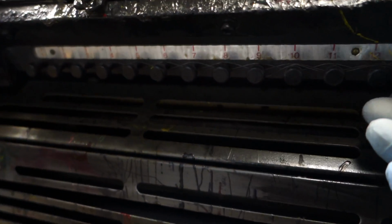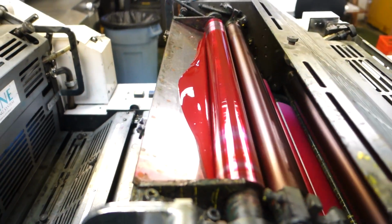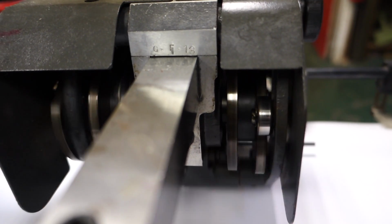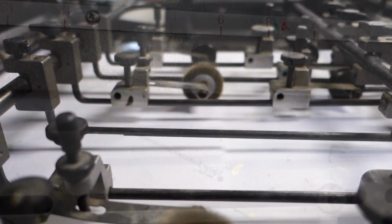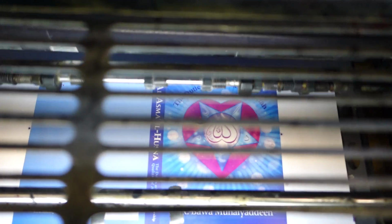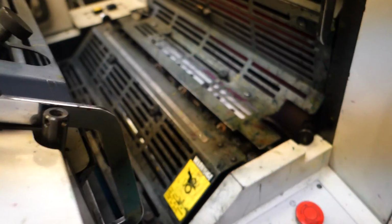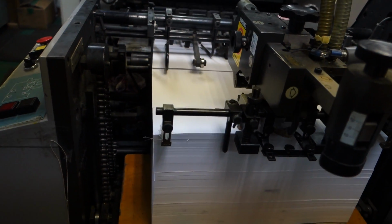And it's not an automatic process. You have to go through and adjust each of these keys. And it's trial and error, and it's not automatic. It's not a Xerox machine. So these are the first 2 colors coming off. And they have to be registered perfectly within a hair's breadth. Because if it isn't, when the next 2 colors go down, you'll end up looking like the front of TV Guide, or some blurred images where the color will be off.